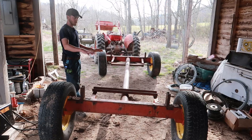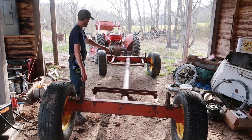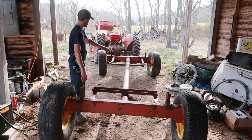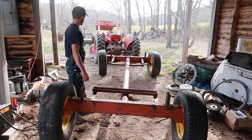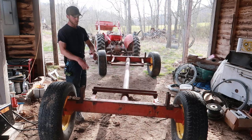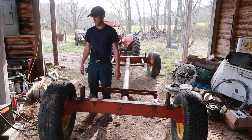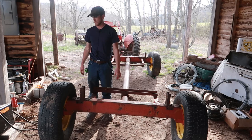For the structure — kind of the base structure that we're going to put on here — the initial wood that everything else is going to be built on top of — there's going to be two, I guess we'll call them stringers. One will go from this piece of channel to the piece of channel here, and another one from that piece of channel to the other piece of channel up at the front. These will have to be 18 feet long because they're setting the length for the bed of our chicken coop. I think those are going to be maybe like a four by eight. So four by eight by 18 — I'll need two of those. And then on top of that, going crossways, I think I'll put some four by fours. I think I'll need ten of those.